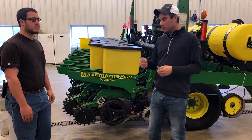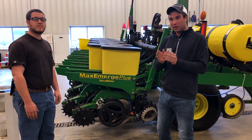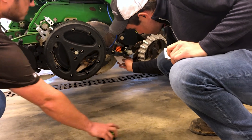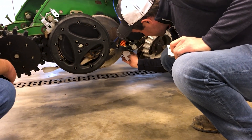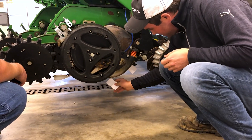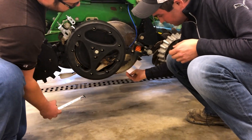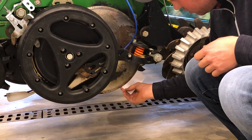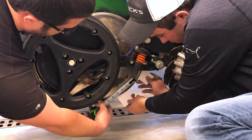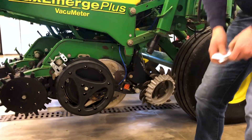While we've got the disc openers off and we put those back on, we want to make sure they're gapped right. We should have an inch to two inches of contact with the two blades where they come together. To check this, simply take two business cards — stick one in from the top where the disc openers are open, run it down until it stops, then take the next one and come up from the bottom. As you can see here, it's a good thing we checked because these two disc openers have worn enough that they're no longer touching. You shouldn't be able to run those business cards together; ideally you'd want them to stop within that one to two inch range.